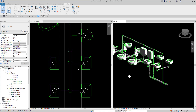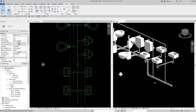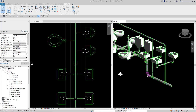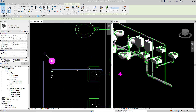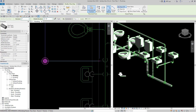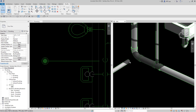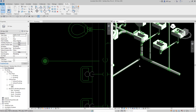The last thing we need to do is draw our floor drains — those are right there. We need to make sure we have enough space between this fitting and our piece of pipe. It doesn't look like we'll have enough because these fittings are going to be in our way. So let's go ahead and draw some pipe from the floor plan view, drop it down to negative two feet first, and go this way to measure where we're at. If we kept going, it would draw right into that elbow fitting, so we're probably going to have to angle this piece and use a Y fitting into this piece right here.